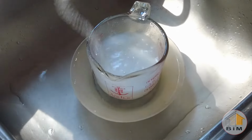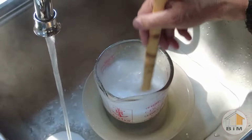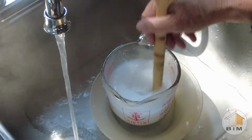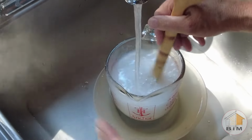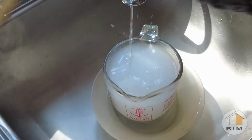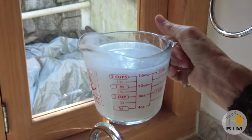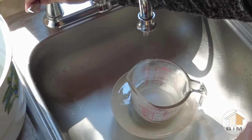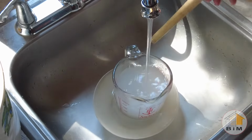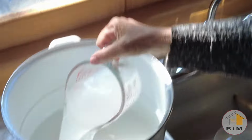And we pre-mix it so it's partially dissolved to start with. Part of that is we don't have access to hot water in the wood shop, so we do an initial mix up here in the office where we've got hot water, and then use a hot plate in the workshop to keep the borax dissolved in the water solution. I noticed there's quite a few sites online suggesting warm water, but it's got to be almost boiling.